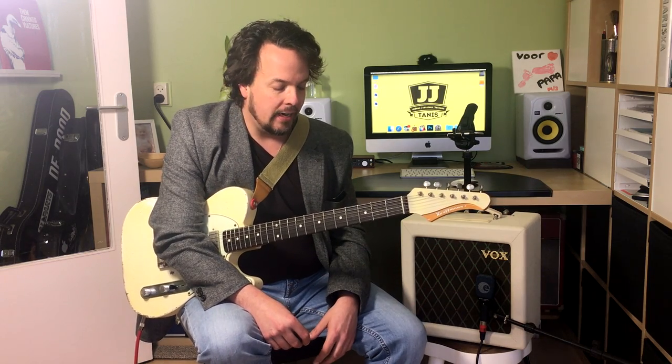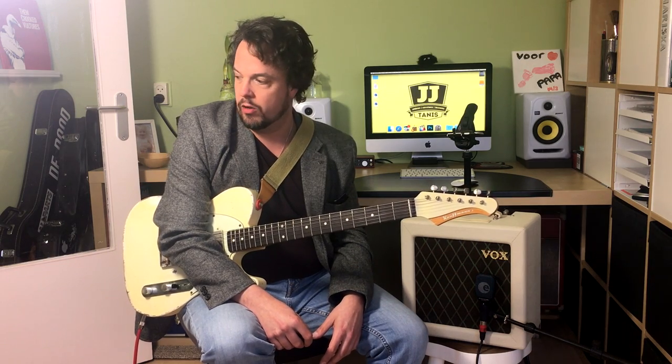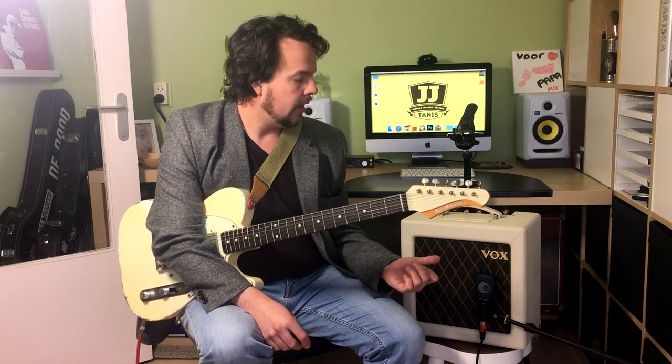I know a lot of guys will say, well, you need this and that tube, Mullards or JJs or whatever. But basically, I learned from Mike Matthews himself back in 2014 that Electro-Harmonix controls 70% of the tube market anyway. Most of those tubes are just rebranded. So really, I think Electro-Harmonix tubes are going to sound fine in this amplifier. You could even opt for a speaker upgrade and put in a more efficient 10-inch speaker to make it sound even better, but that is the last modification you want to do to an amplifier.